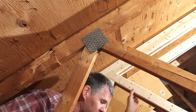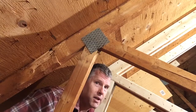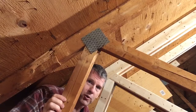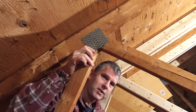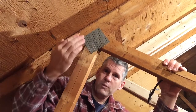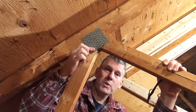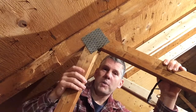This is an eight-foot two by four - it is a select grade. We'll talk later about all of the grades that the engineer had to specify. What's going to happen is we'll put a new one on this side and a new one on this side, and that's going to splice this joint and hold it like a splint - it'll make it much stronger than before. There's no way for us to reconnect the connector plates, but we can salvage this gusset plate. It's still firm and holding the web members, but we need to get it tight to the wood. First job is to tighten up this gusset plate so we can get our two by four and two by three as close as possible to the existing wood.